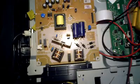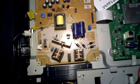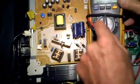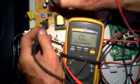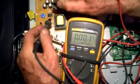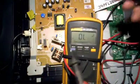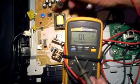In a situation like this, one of the first things I'm going to do is start checking the diodes on the secondary side of the switching transformer — what many call the cold side. I'll put my meter on diode check and start looking for shorts. Did I get lucky the first time? Well, that one's shorted too, and so is that one and that one. Actually, they're all on the same power rail, so it doesn't matter which one I check.